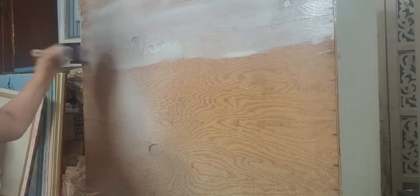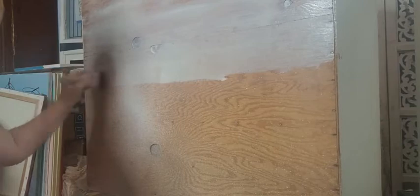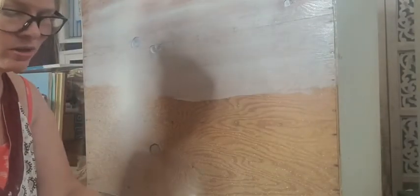I'm not worried about bleed-through because the wood will not bleed through for paint that goes over it — it depends on the type of wood and the color. But what I'm doing is stopping that smell. Even though I cleaned these with White Lightning and really scrubbed them down and sanded them, they still have that old basement smell. So I am salvaging these. Originally, I got them to put legs on them and windows on the front to make cabinets, but then I realized I needed some bookshelves underneath my kitchen bar for my supplies, staging props, et cetera. The BOSS doesn't smell — low VOCs.